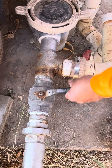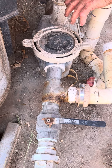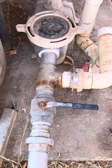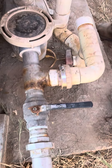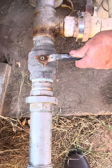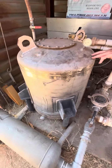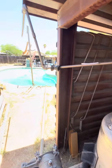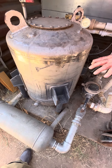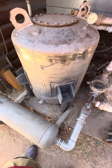You just break this here a little bit, and you can see the air come in here, and you shut that right off. And let the air come out of here — you have to play with this three to five minutes to suck the air out of there to have it primed again. Then you shut this here off to save it for the next emergency. The old fiberglass tank I had here leaked, and that's why I put the valve out there to keep this charged with water. If you didn't, it would drain itself back to the pool and you'd lose your prime.